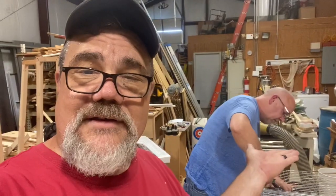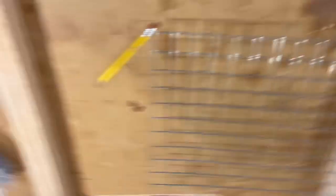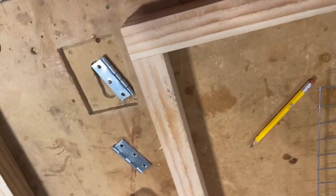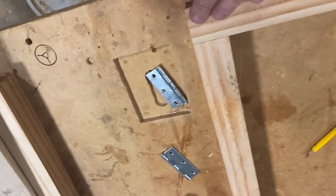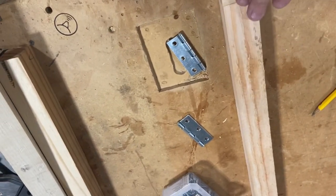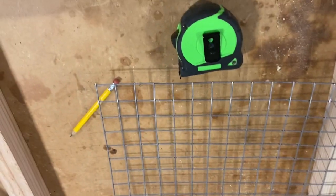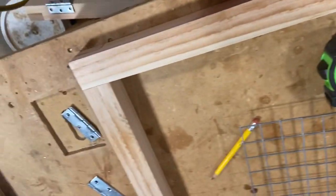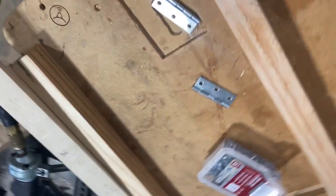I'm going to hold up here a second because I might need my lovely assistant Andy to operate the camera. What I did was marked two and a half inches off the edge both ways. If you notice, I did all the construction with half-lap joints — see the half lap? They're glued and screwed. Where the hinges go, I want the longest piece on top, and then this you can put in the other direction. I just like it better that way, it's my own personal preference.